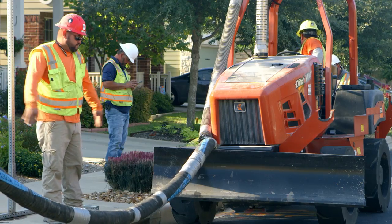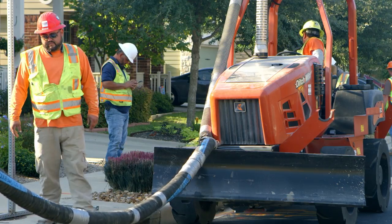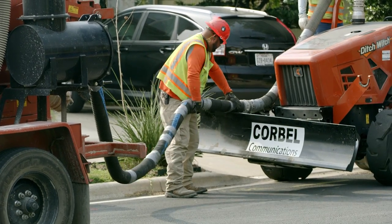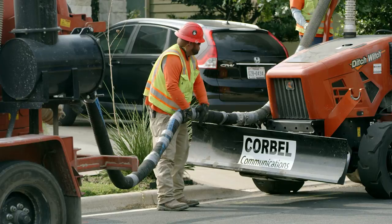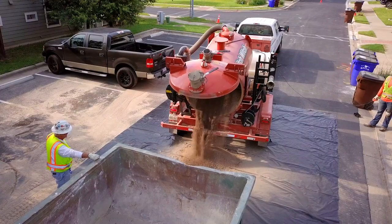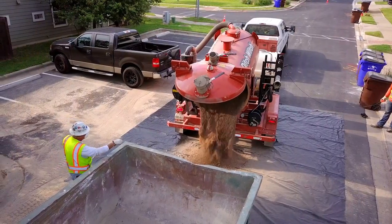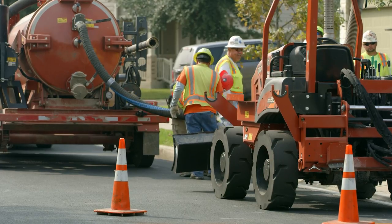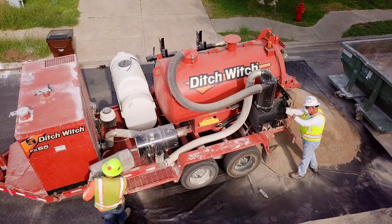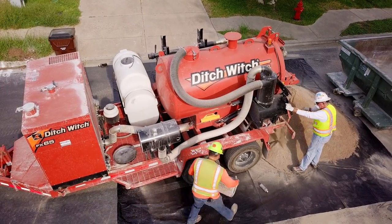If the vacuum has stopped removing spoils, that may indicate a clogged hose or full tank. If a clogged hose cannot be cleared by manipulating the hose, shut down the microtrencher and vacuum excavator to correct it. Only empty the tank at approved sites. Check inside of trencher vacuum hoses periodically for any caked spoils. Follow manufacturer recommendations to clean the filters.